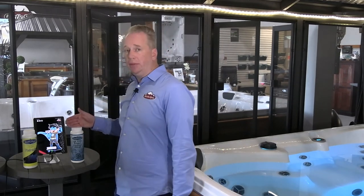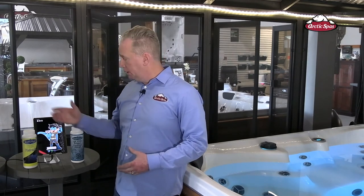In review, caring for the Spa Boy water care system is really quite easy. If your pH is high, simply add some Salt Water Balance to bring the level down. If you've got cloudy water or foam buildup, add Refresh. Now let's talk about draining and filling your spa and potentially replacing your salt cell.